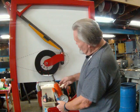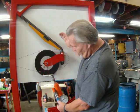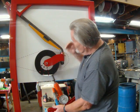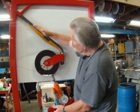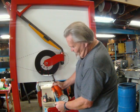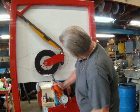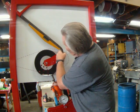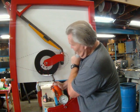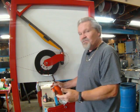Now as you can see, the gear leg isn't going up at the same rate that it was before, and we've already got the 400 pounds on here. What you see is the gear leg is bending this direction because of the caster. So we can go up here, there's 500, and you can see the gear leg is still in position where it belongs. This is great. You probably would never see any more than this in a normal landing.